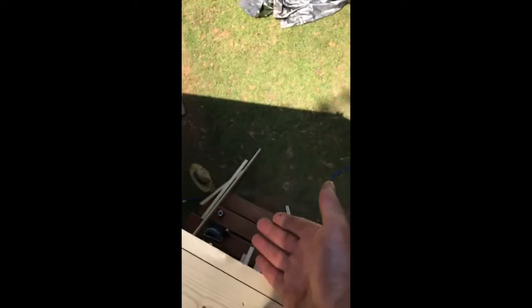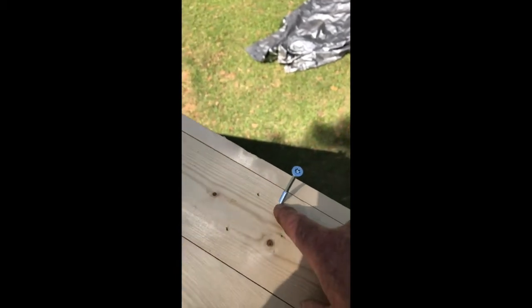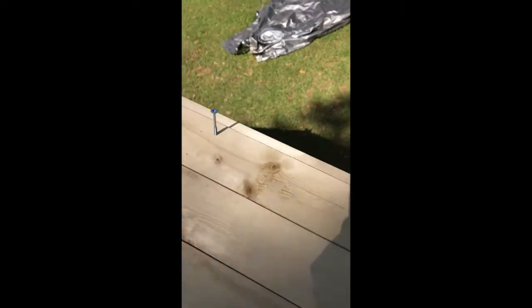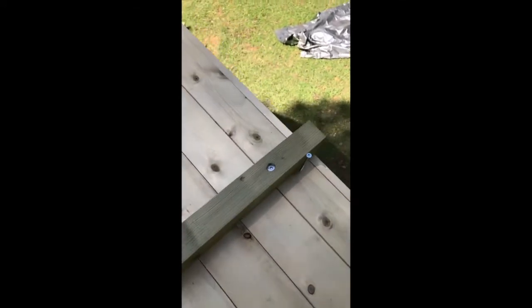As you come down you've got your next beam just under here. You can see we've tacked on these ceiling boards here — the roofing boards — and the beam in this case is on a slight angle. I've put a screw in here and I'm going to run a string line across to the other end; there's another screw on the next beam. You don't have to put them on every beam, but the rule of thumb is every one meter there should be a roof batten, mainly so that when you're walking along the roof you don't put dents in it.